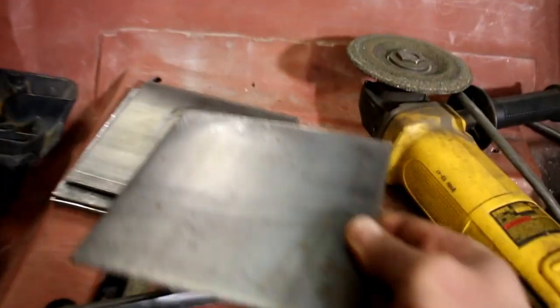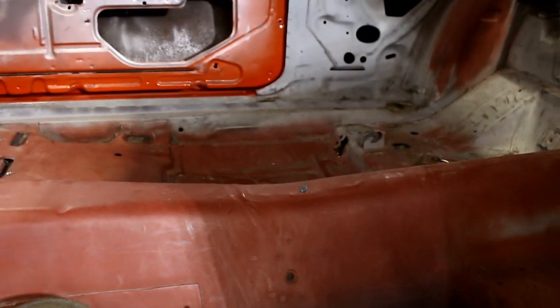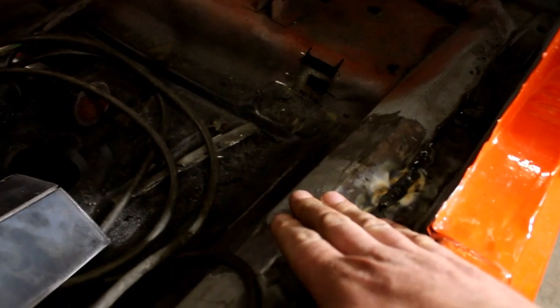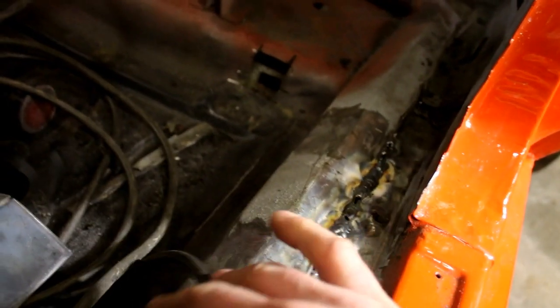I'm not going to bother videoing the whole thing, because on a unibody car you're going to have to use these plates. These plates need to be welded where the bar goes to the floor. If it had a frame, you're supposed to hook them to the frame, I believe, but I've never done that because I've never done a full frame car before. I like welding the plates down. They say you can through bolt them as well. I don't like that. Welding's way better, and it's going to look a lot cleaner. You can put carpet around it and hide everything really well.